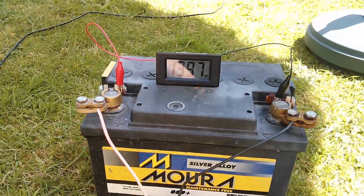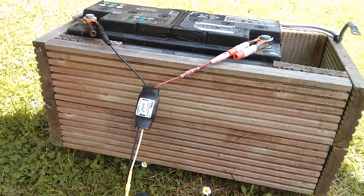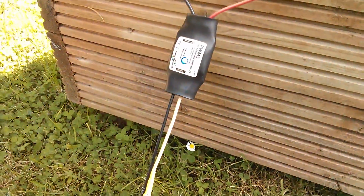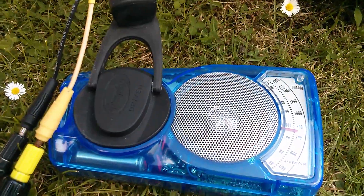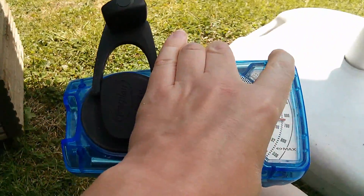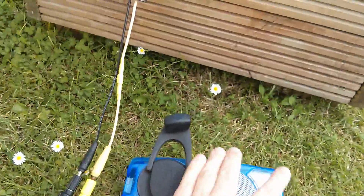The PWM5 can also be heard on the AM waveband — this one has a modulation frequency of 122 Hz, so it's a lower frequency. I've got to get it quite close to the solar wires to make this happen; if I move it away even about a foot, the radiation drops to the point where it can't be heard.